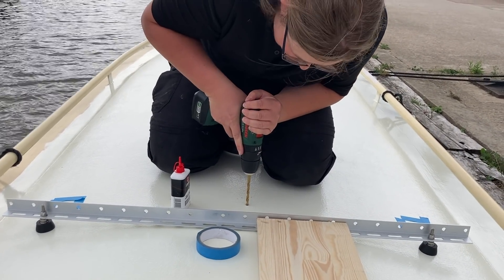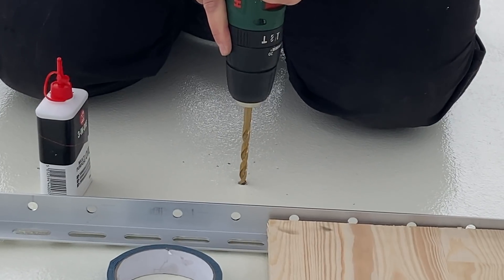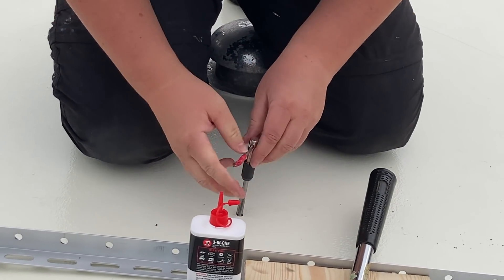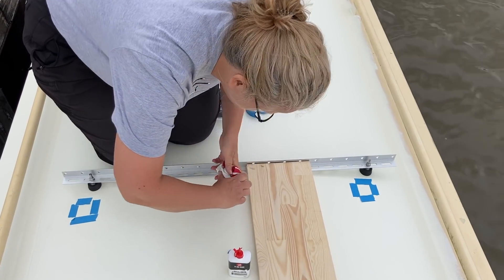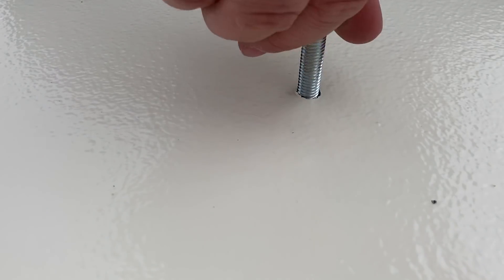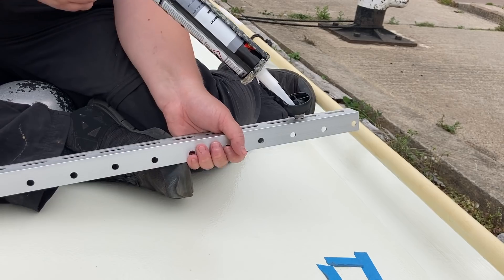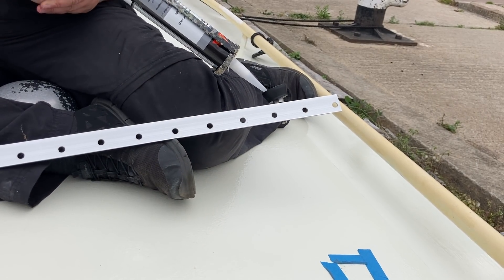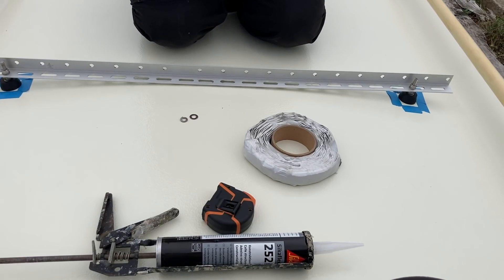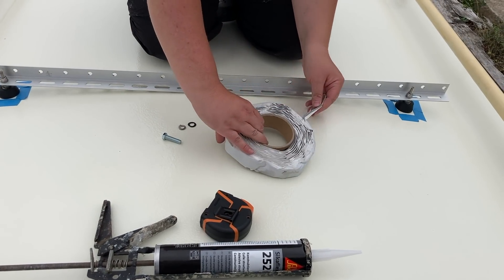I did make sure I had a spare drill bit just in case, but I didn't need it. The tap wrench came with an M8 tapper but it was a terrible tool to use as the wrench was so small. Luckily there were two of us to tap the four holes. I've put a link in the description to the tool that I bought and also a link to the tool that I wish I'd bought. With the holes done, it was time to get the Sikaflex out. To minimise the mess we put some masking tape around where the feet were going to go and then filled each foot with lots and lots of glue. Marking the position of the feet also meant that when we needed to put the rail down in its position, it was really easy to get everything lined up.